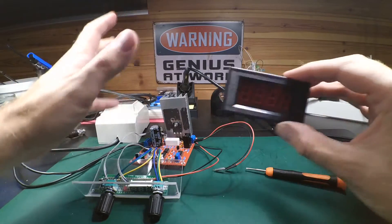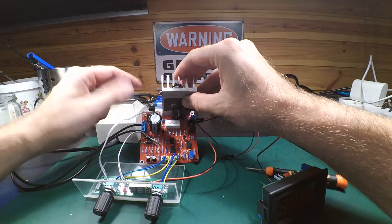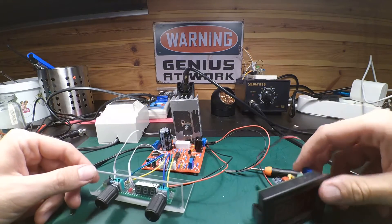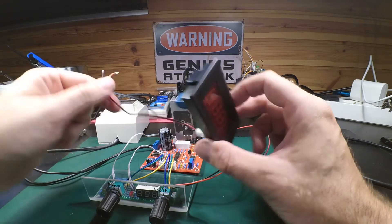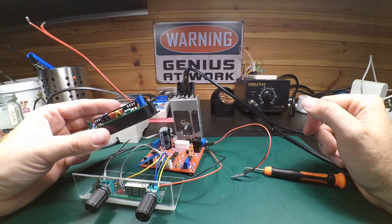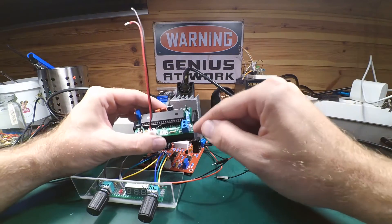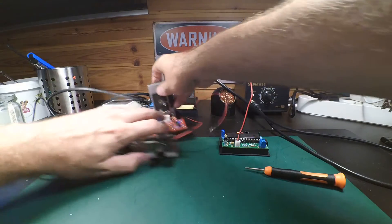Let's connect this now. You've seen my earlier videos where I switched out the voltage regulator - in the original it was a 24 volt for a fan, but now it's a 5 volt regulator. That goes out through my little green LED which is on when the power is on. This current display needs 5 volt to work, so I'm going to pick out the 5 volt from here. Then we have the output of the power supply - I'm going to take the positive lead in to positive in, and then take another red lead from minus out as my new positive lead.